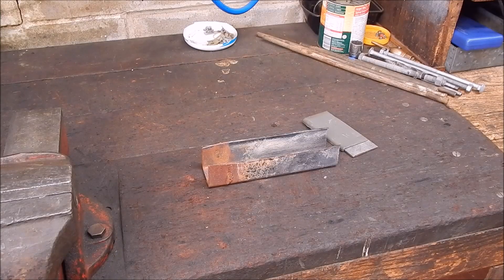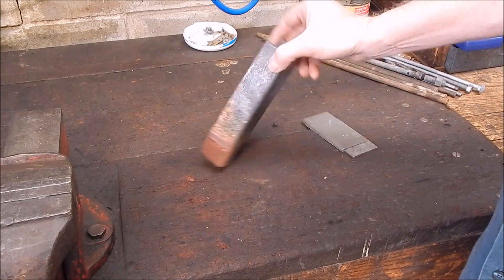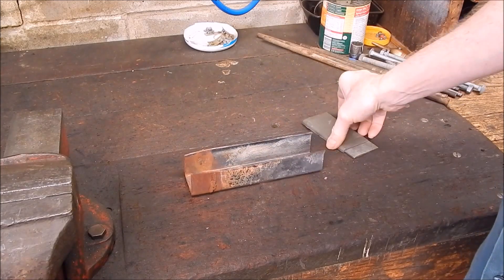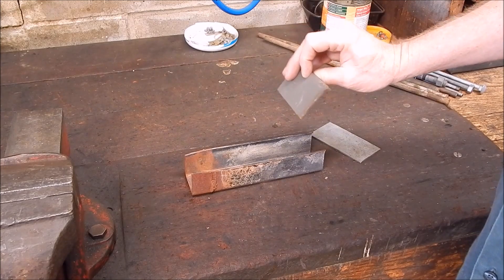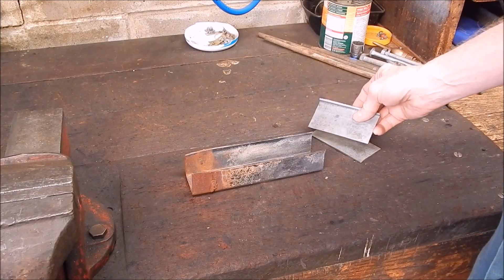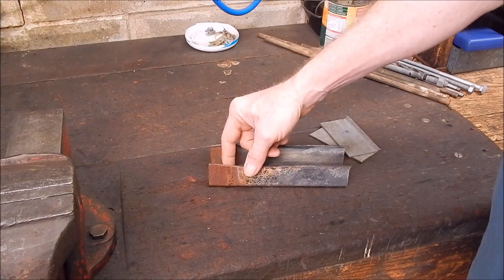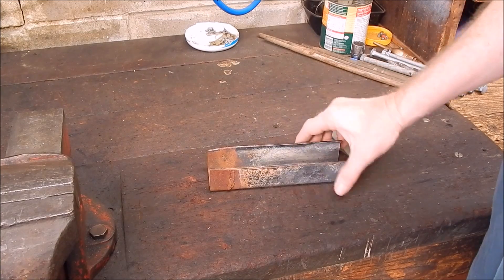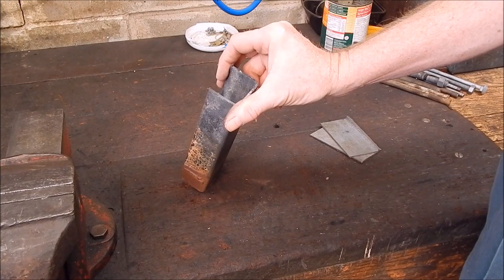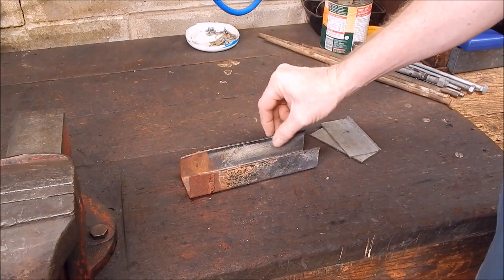To make our mould, all we're going to use is a bit of old crappy U-section and a couple of bits of scrap plate. We're just going to cut and shape this, and weld the plates on each end. So I'll be slicing through here, take off this cruddy bit. The main thing with these moulds to make sure the aluminium will come out is — even though aluminium will shrink — you really want to have a little bit of angle on the sides so that it won't jam in there.